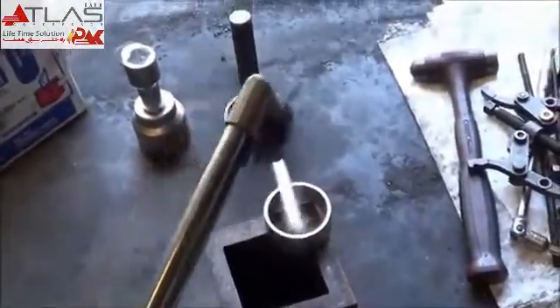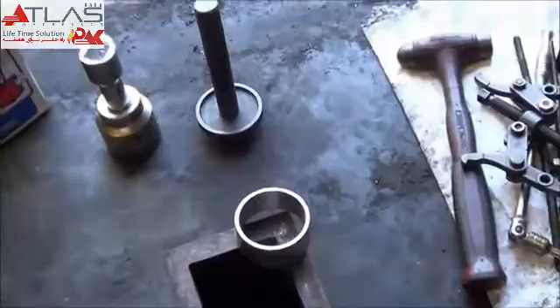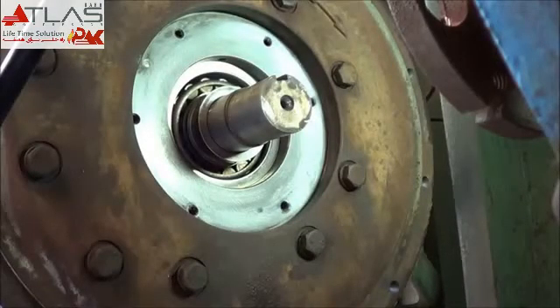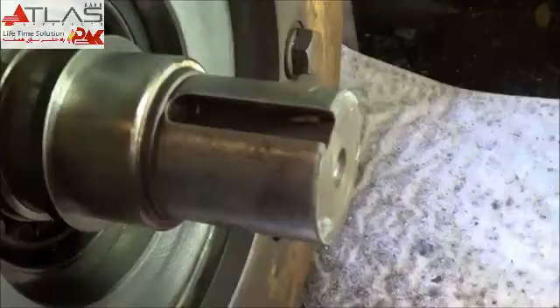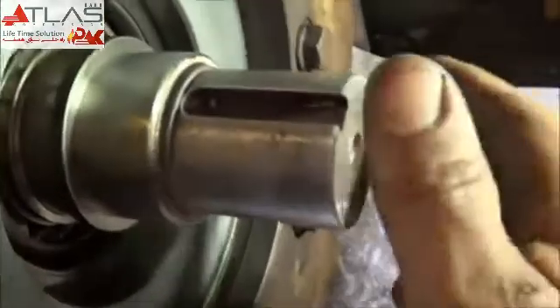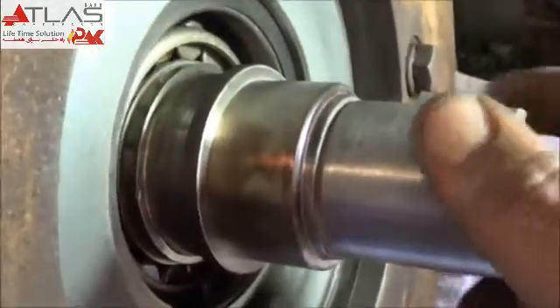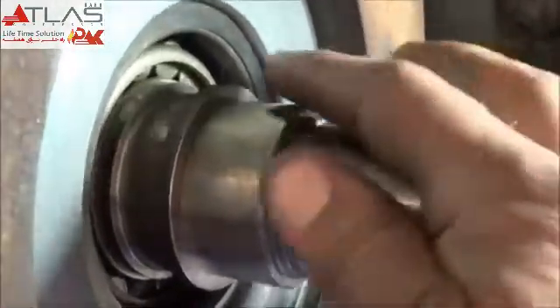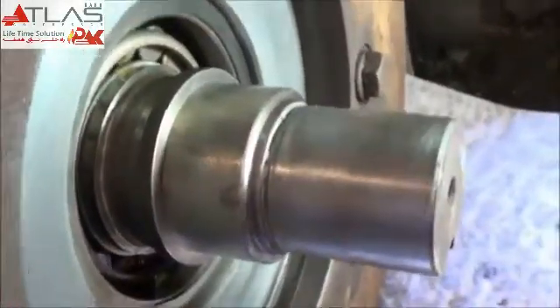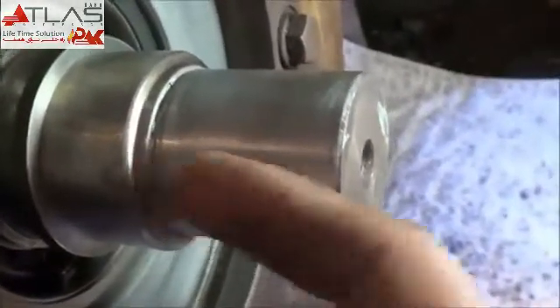We're just going to heat this up, heat it up, and then touch the marker to it. When it melts, you'll know that it's up to temperature, and then I'm going to slide it on the shaft. That slid on there pretty darn good. Probably heated it up a little bit more than I really needed to. You can see it's got a little straw color to it — but it's just a wear sleeve, not a bearing, so you can't damage it. Now we're just going to clean this up with some emery paper, and then we'll put the seal back in. One important thing to remember is there's a chamfer right here — you want to make sure you get that chamfer to the easy side.